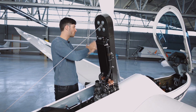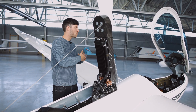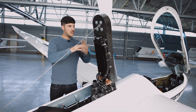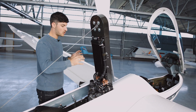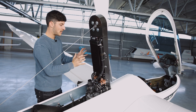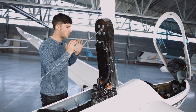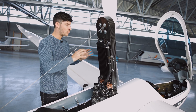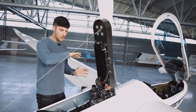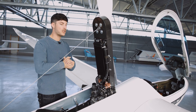First of all you need to go into the glider, make your preflight check and so on, so it will take some time. If the engine is on the outside, the UV light will damage all these rubber parts slightly. Everything here is in black color so it will also heat up — you can get gas bubbles and so on. For this system it is better to retract it and only have it open when you start.